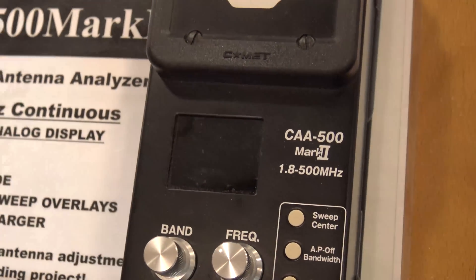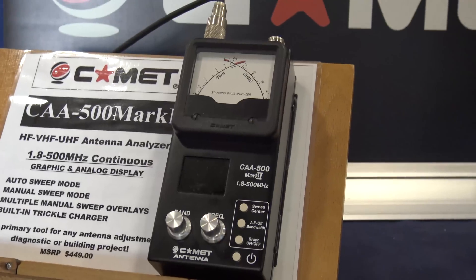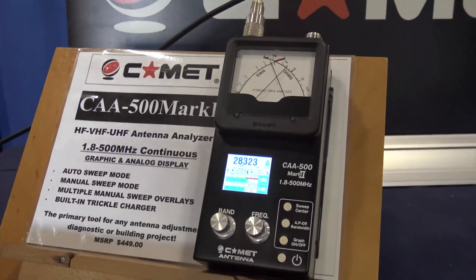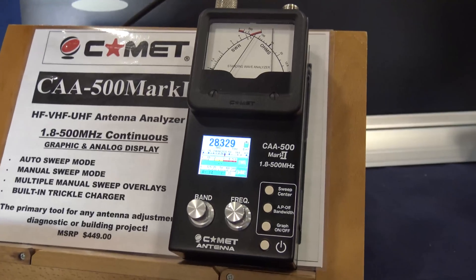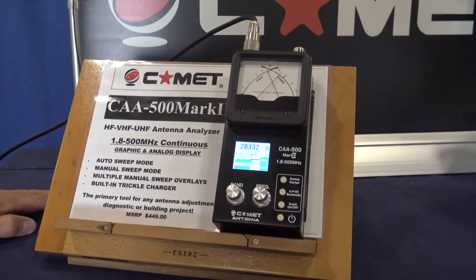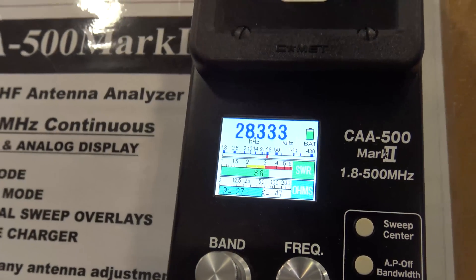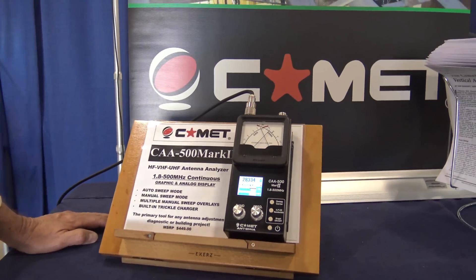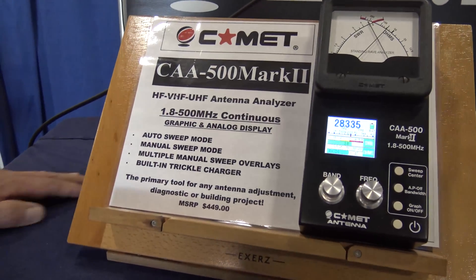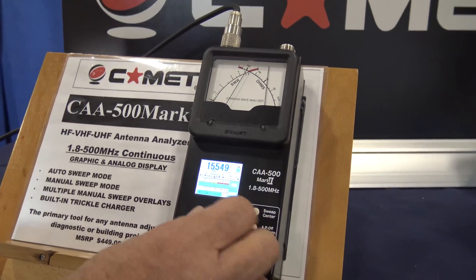Now let me ask you something, Mick, because I've been fighting this and people have been beating me up on YouTube. I am a fan of resonant antennas — that's what I do, use analyzers — and people are so gung-ho on using tuners and tuning at 15 to 1 SWR. Tell them why it's important to have an analyzer to make sure your antenna is resonant, because evidently they don't believe me. That's where it's most efficient — that's where you're going to get your best performance, your best receive, your best transmit. You've got to use an antenna tuner sometimes if you've got a big antenna and you can't go up on a ladder or up in a tower to change the element lengths. But whatever band you most want to optimize, you've got to have it resonant.